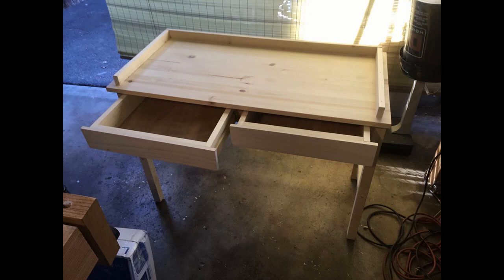So that's it. There's your finished product. You saw some other pictures of it. Serves my daughter well. Little drawers, smooth action. I put little maple fronts on the front, urethane finish all around, and pine. Got everything from Lowe's, the ponderosa pine for the top, and 2x2s for the structure, and one vise with a little railing on top. Very inexpensive, not expensive to make. It can all be made with a hand saw and skill saw. You don't need a table saw.